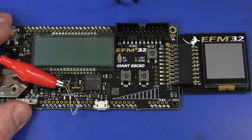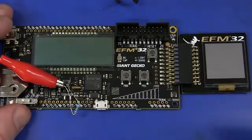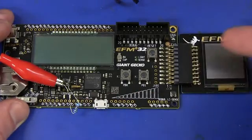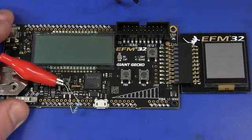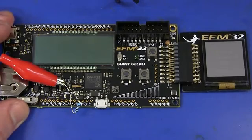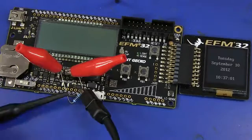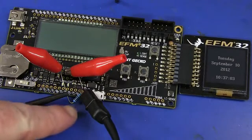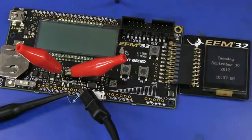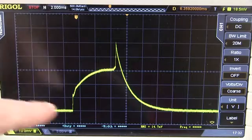Now, you don't necessarily need a MicroCurrent to measure current here — in this case I've got a 1K resistor instead, which we can put the oscilloscope across. But that 1K resistor doesn't even start the circuit up at all. The value is too high; it just chokes off all the current, because the MicroCurrent has a 10 ohm current shunt resistor for exactly the same amplitude output — 100 times less.